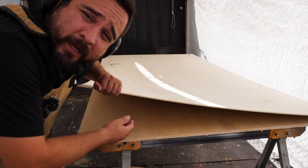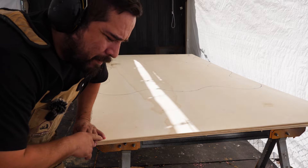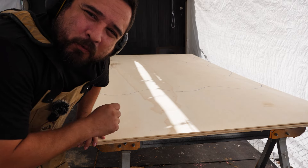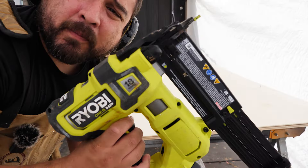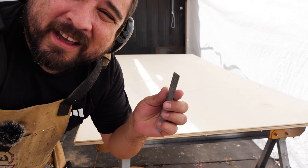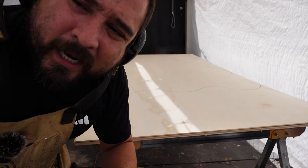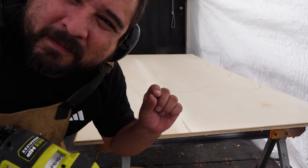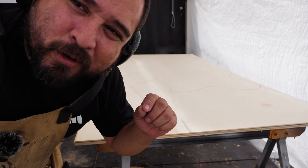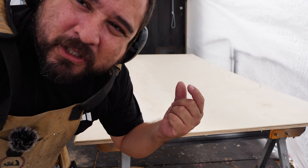This is the quarter-inch and this is the half-inch. We're going to line them up exactly together, add a little brad nail so they don't move, and cut them out together. I thought I had some half-inch brad nails but I only have five-eighths — we'll use five-eighths. If you're getting them, get the half-inch; it works out a lot better. Some might poke out in the back. If you're using screws, just use half-inch screws.